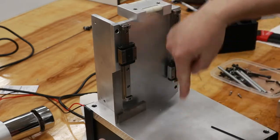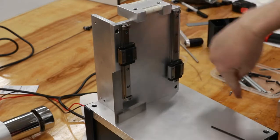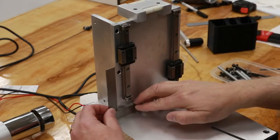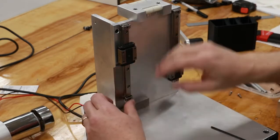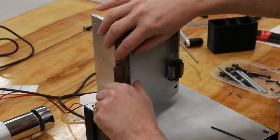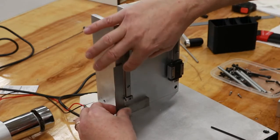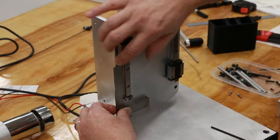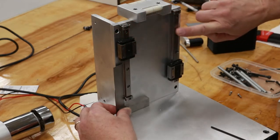So that way all my holes, as the drill bit's going through, it's going straight into the hole and not going down at an exaggerated angle like this. So I'm going to use the most precise tool I've got, a machinist square. I'm going to bring that up against this linear rail, and I'm going to adjust it so that it's perfectly square to this. Then the next step will be to put a joining bar between this rail and this rail,